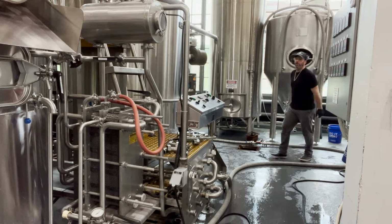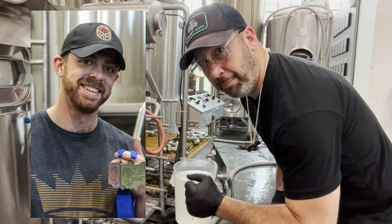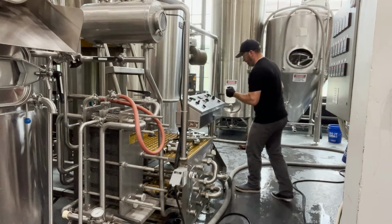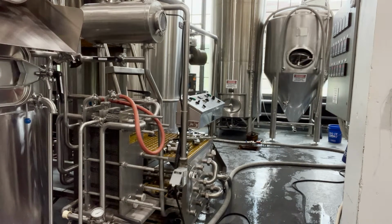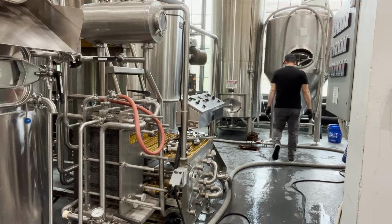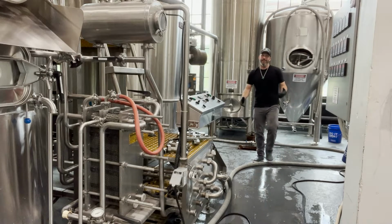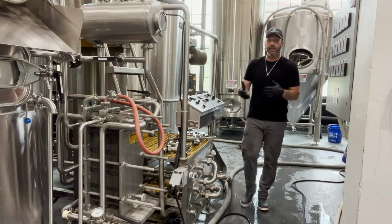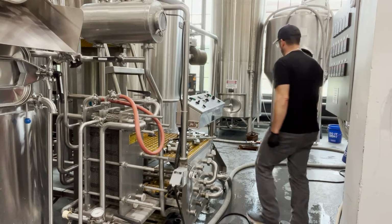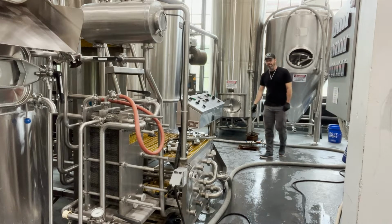All right, we're moving. We got water going through. Josh Halpert has already measured up my caustic for me, adding that to the kettle as we speak. For heavy soil like this, I like to couple up this caustic with a booster, which is, I believe, a hydrogen peroxide booster. You can check, it's like an oxidating thing. It does help to create bubbles and or turbulence as you are circulating your chemical. And it does a great job at helping to break down some nasty soil.